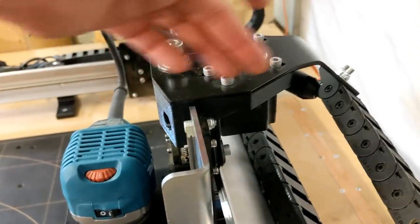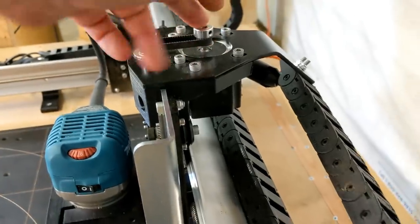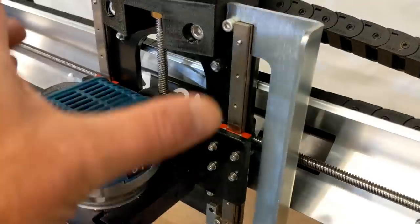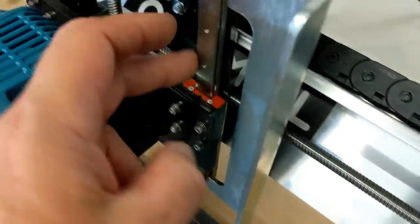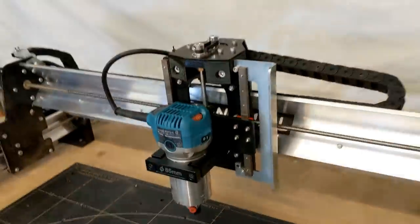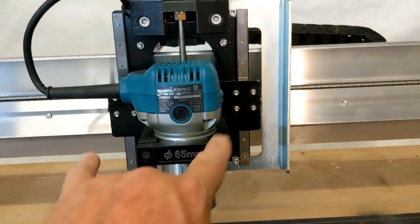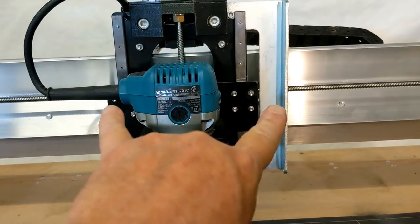And then they have this plate up here, which is a little bit thinner. It's a mounting plate for the motor and your drag chain. And we'll talk about that during the assembly. The Z-axis goes up and down on linear rails. And those linear rails have linear bearings that ride up and down with it. So looking at the front of the machine, you can see that it's pretty wide right here, which gives it a lot of squareness that way.